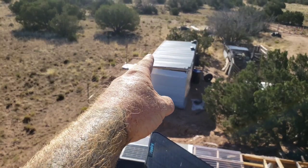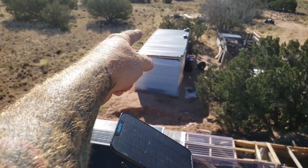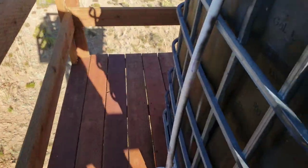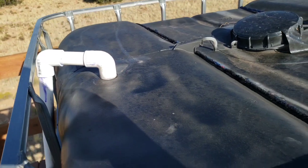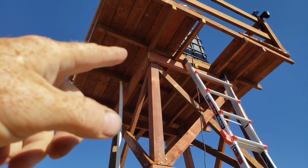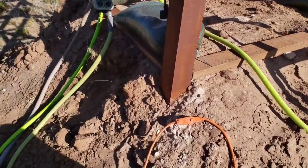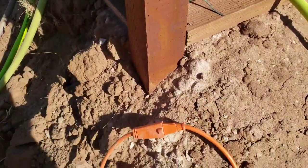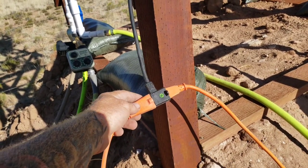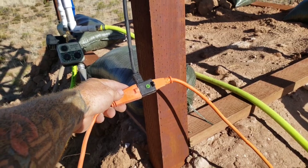I finally set the pump up at the cistern — that's 3,600 gallons, it harvests rainwater from that surface. Because the pump is pumping water all the way up this hose, it connects to the PVC here and comes into the top of the tank. I have a float switch up in the tank that will activate and tell the system to turn on and pump water up to the container. It's about half full so it needs to be almost empty before it activates. I connected the wires directly, but I'll unplug those now and plug them into the switch.